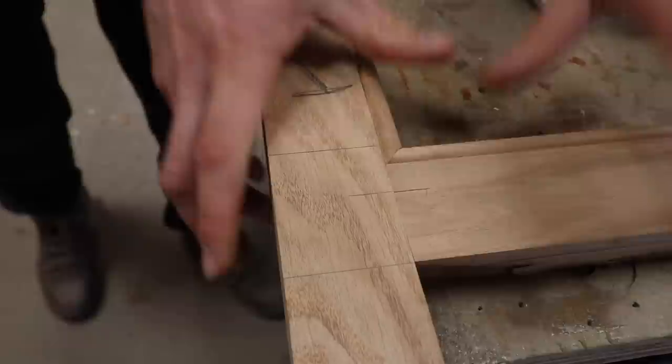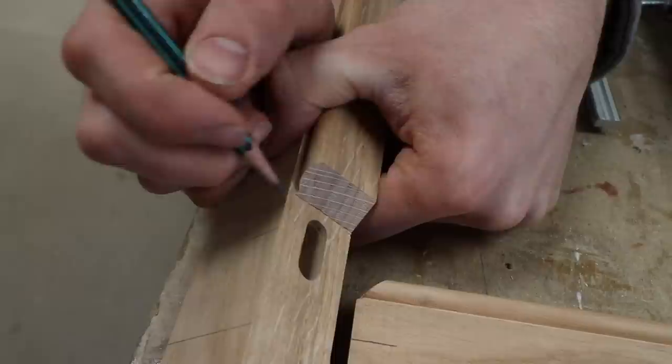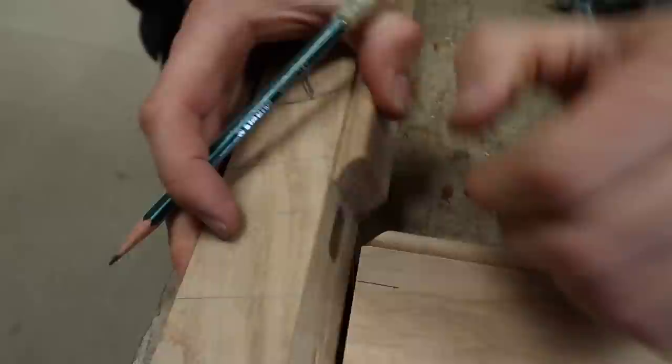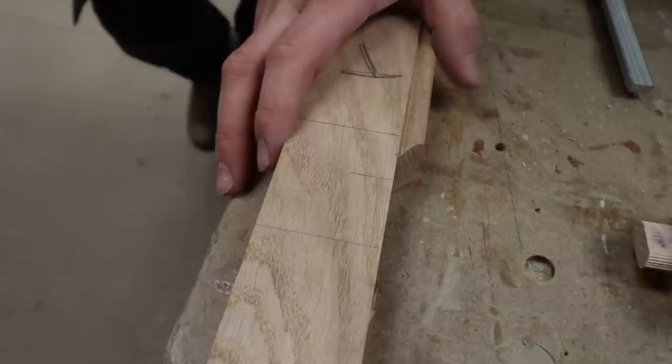So you can see how important it is now that the joints get together not to cut into this corner. If your chisel is extending into this piece of wood here and leaving marks, it will dig in here and show a little nick mark. And then when you put that together like that, you'll see where that pencil line is, a little nick mark in your timber, and it just looks horrible and unprofessional. So it's really, really important that that chisel line between there and this 45 degree just stays nice and sharp in the corner. Okay, so repeat that for all four corners and we'll have a nice little frame to put together.